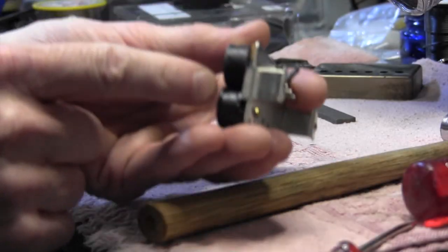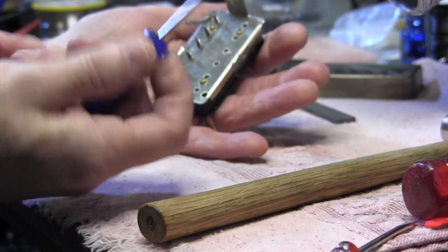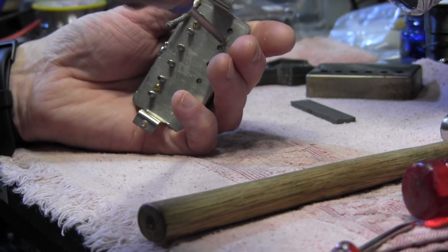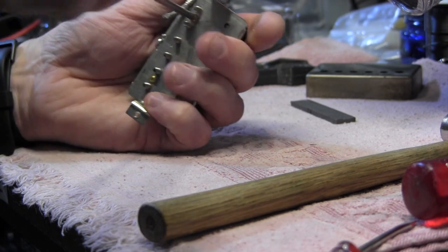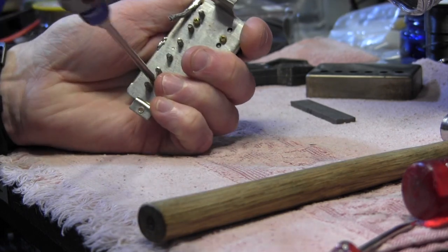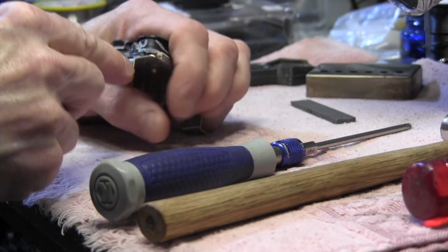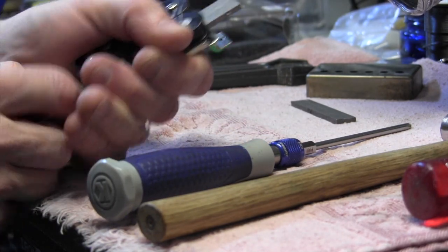You'll notice there's wiring at one side, and on the other side you can see the magnet on the back. These four screws hold the bobbins in, so we're going to loosen up these four screws — not take them out, just loosen them. Okay, all four are loosened up now. I'm going to use this little flat-head screwdriver to just push the magnet right out.